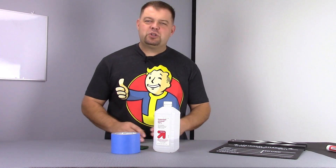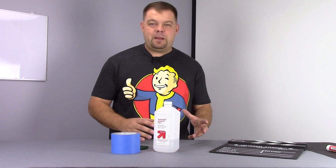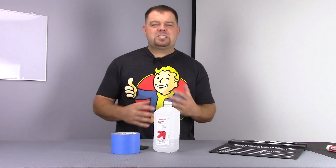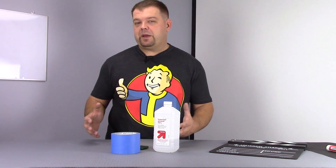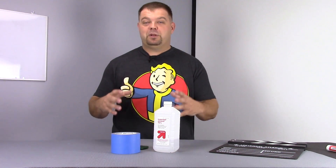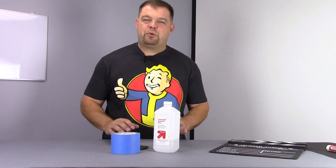As you can see, there's a huge difference in adhesion from unprepped tape to heavily prepped tape. There isn't really a perfect surface, but if you're printing something that has really small feet, small legs, or something like that, definitely consider some heavily prepped blue painter's tape. But if you have something with a really big surface area — like a great big plate or a parts tray — then stick with the PEI or the Kapton tape, otherwise you'll have a really hard time breaking it away.